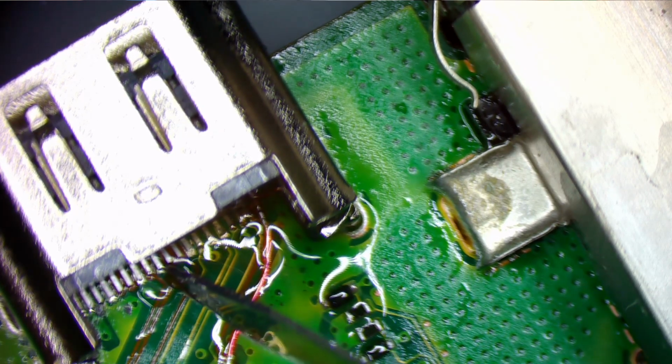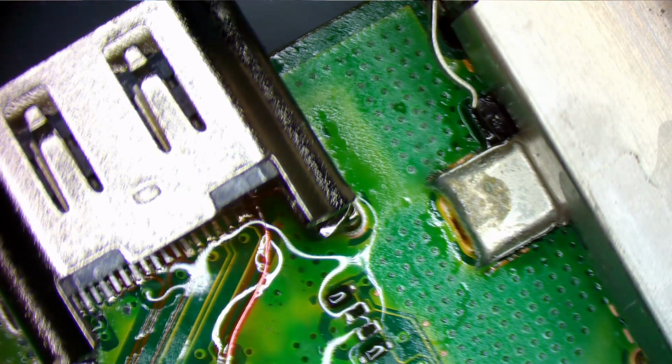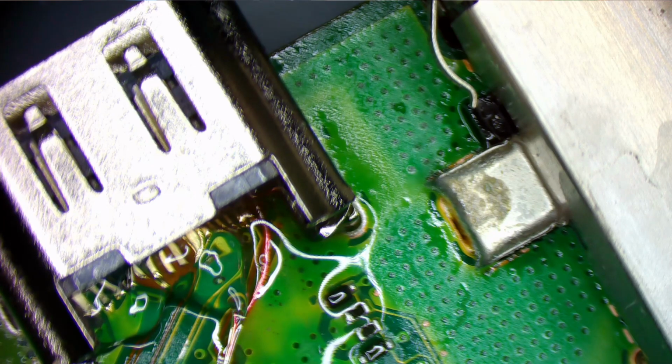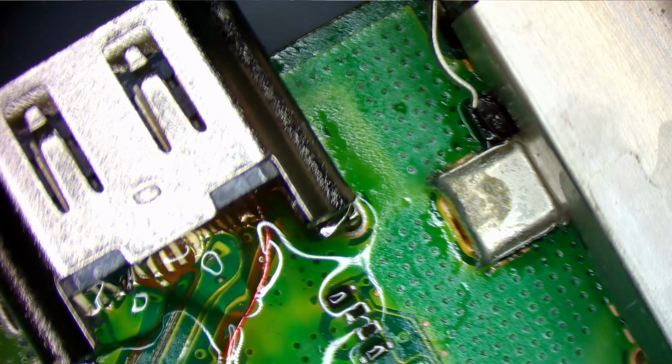That pin's not connected. That pin's not connected either. Here's that pin, so I need to solder these down better. So I'm going to add a little bit more flux in here. And I have the wrong iron again. I always find I switch irons a lot. I was tempted to take my tweezers off and hook up my other regular iron, one with a big tip and one with the tip I need. So just take a minute to heat up here.